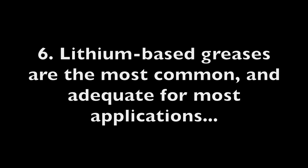On a mower, you don't need a $12 tube of grease. But you still want a good string of additives so you have corrosion protection and oxidation protection. Most greases at the store are going to say lithium on them — that refers to the thickener. Lithium is one of the best all-purpose greases you can get. For a mower, I'd go to the store and look for a lithium grease that's probably $3 or $4 a tube. It should say anti-corrosion and water-resistant on the box, because if your machine sits outside and gets rained on, you don't want that grease to wash out. If it washes out and there's no corrosion inhibitor, you're going to get rust — and that's where your bearing or bushing is going to fail.